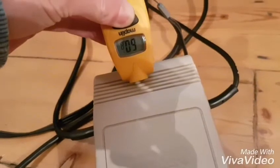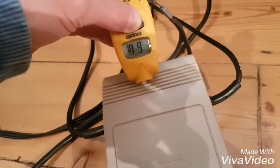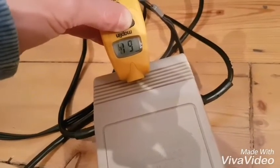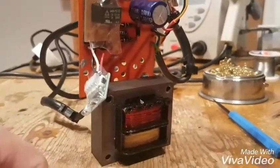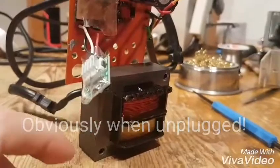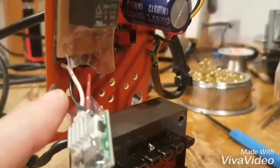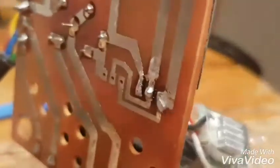Just as an afterthought — it's hardly surprising these things fail. This has been on for an hour now just testing it out, still good. That's outside the case after a heat sink, so you can imagine what the temperature is inside that little regulator. That's why they fail. So even though that worked with leaving the linear regulator in, it was getting so hot — the heat sink was ridiculous to touch. So I'm going to swap that out for a switching regulator. All I've done is ream the holes out a little bit bigger and put the wires through where the pins on the regulator were. You've just got to be careful because these traces are very badly stuck down. There's no bridging — I've checked.